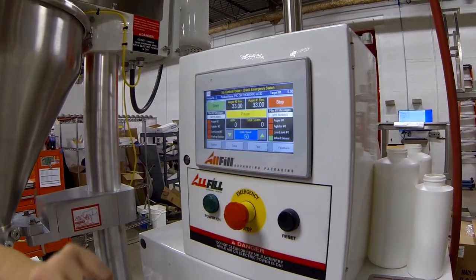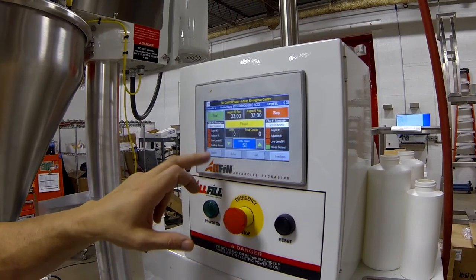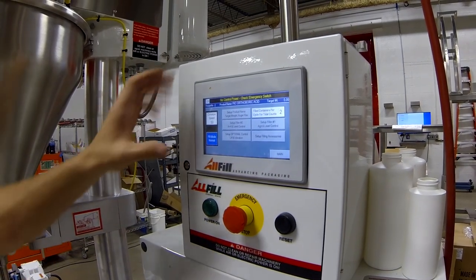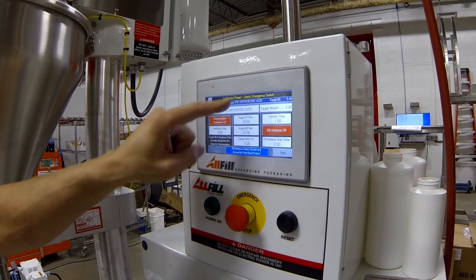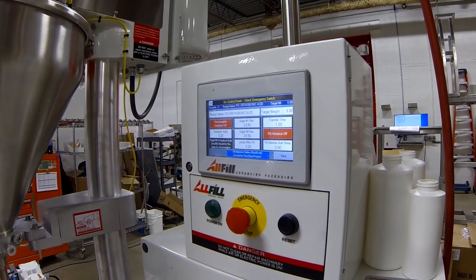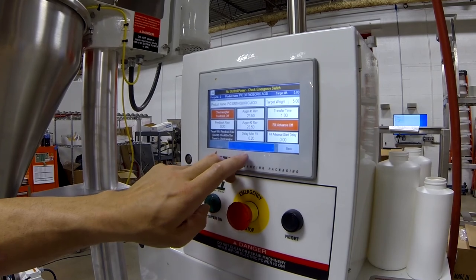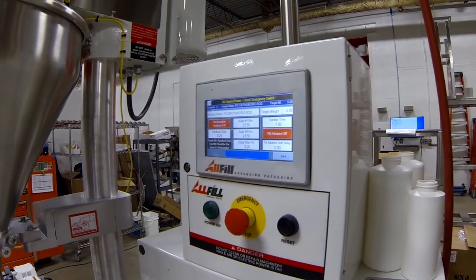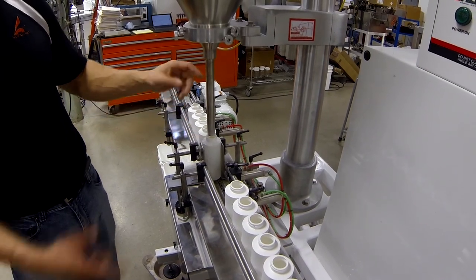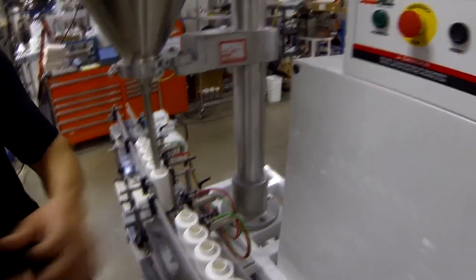Set date and time — speaks for itself. Jump back to the main screen. Setup: once you pick a recipe you're going to write to, this is where you would set up your initial recipe — the name, all your order parameters, transfer time, fill advance, delay after fill, all the settings for moving and filling the container. Note: fill advance is for free flow products only. What that means is as you're bringing a bottle in, you can start the filling portion before the bottle gets into place. With your tooling it's not so easy because you're dosing right at the tip versus free flow where you'd be dosing up high and letting it fall. The feature's there if you get another product to run on the machine.